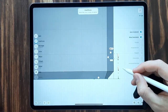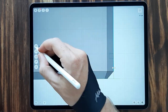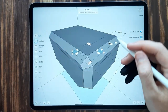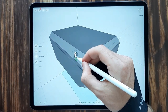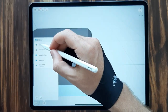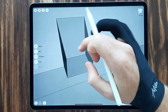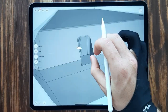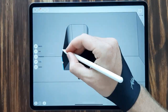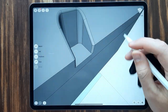And for this, I'm also going to make sure to think about how this is buildable. In this case, first of all, I'm going to extrude it down 4 centimeters, but then you see that I'm going to have these quite sharp edges in the corners, and that you can't really get in reality with any sort of drill. So I'm going to give it a fillet of 4. And with that, I think I'm also going to give a fillet on the outside of 2, just so it's a little bit nicer and it's not as sharp and cutty.